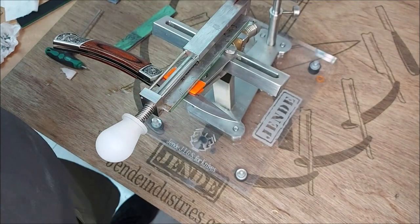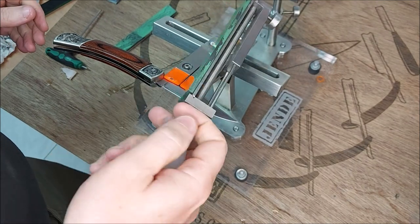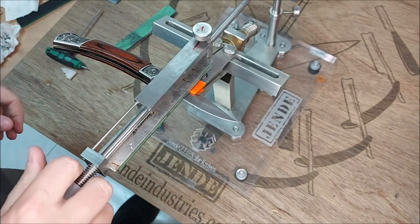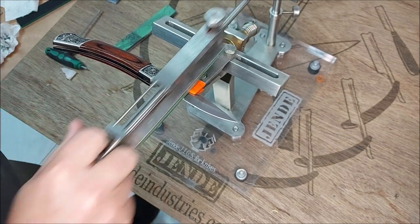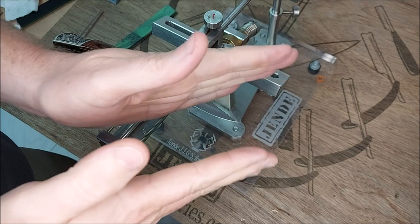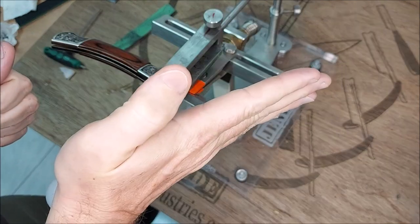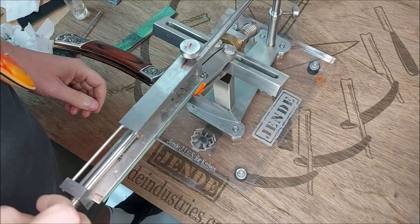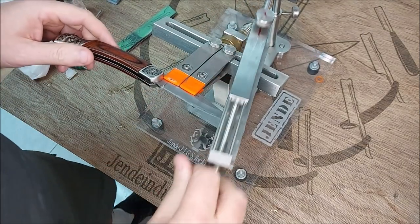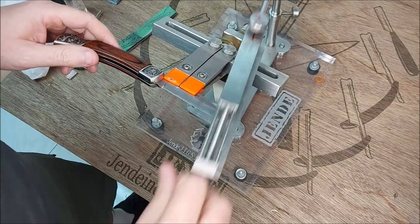So I've just leveled out at 20 degrees. I'm at the 1K now, and just going to do the same thing. I'll start off with a little bit of scrubbing, and I can monitor my scratches to see that they change direction. Right now my scratches are going at an angle, askew, and they're going to be going straight after I'm done. I want to do a couple more scrubbing strokes, especially since the curved areas always seem to require a little extra effort.